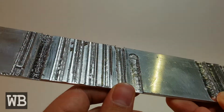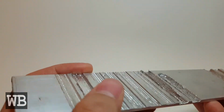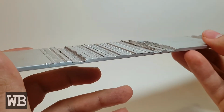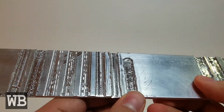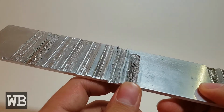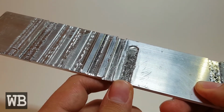Number 5 is a definite no-go. It is a 2 millimeter depth of cut at 75 millimeters per second. And as you can see, the edges did not really get cut, they just sort of melted and were pushed upwards. And moving into number 6, that's the same sort of story. This is now with an adaptive tool clearing path, and that is at the same 2 millimeters depth of cut and 75 millimeters per second feed.